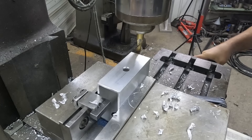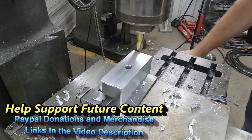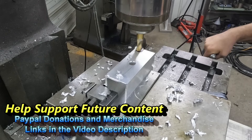So I got it all figured out - where my start, my stop, everything is - and we'll go ahead and start cutting. Climb milling is always best in aluminum, it just seems to peel the material out a little better. Lock that, and let's go ahead and ink our cut. I can probably speed up my end mill a little bit - I might just do that yet, we'll see how this one looks.